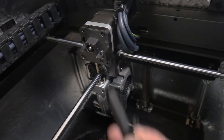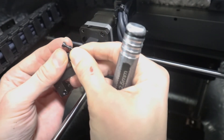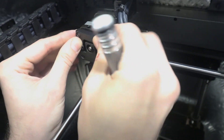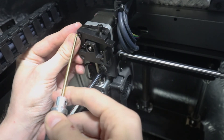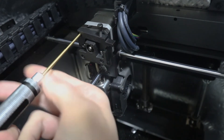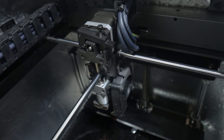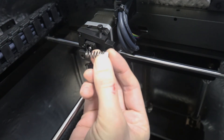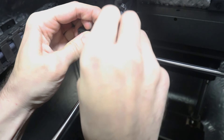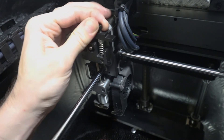Lastly, we've got the extruder lever. Note that on this model there is a little washer on the screw, so make sure that's still there. Stick the lever on there and push the screw back as far as you can. Take the 2.5 millimeter and screw the lever back on. Once it's tight, loosen it back out about two turns so it's nice and loose. Then get the tension back by putting the spring assembly back in — be careful, hold it with as many fingers as you can, stick it down in there and underneath. Center it up and tension your spring back down.